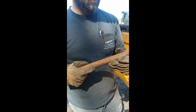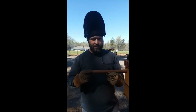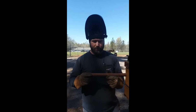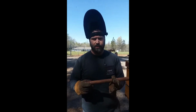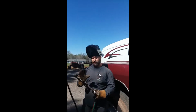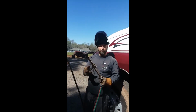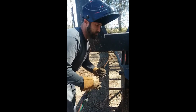And then now we're going to set it up in the hole that it goes in, I think, so this will be easy to hold. And then I'm going to stick a piece of pipe on the end. We're going to heat it up with a torch, and we're going to bend a 90 in it somewhere along in here, I think. Check that drawing again. All right, torch tip on here now. We're going to swap this out to the rosebud tip to give us some more heat and power for that big old piece of rod.